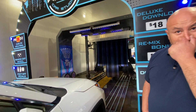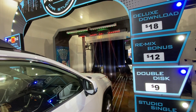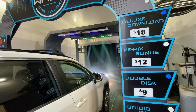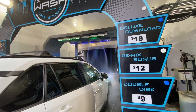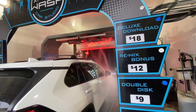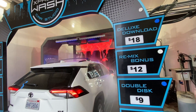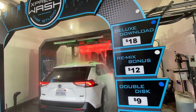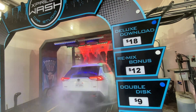This arch is all reclaimed, loads on a 20 horsepower pump. The arch itself is for 96-inch vehicle clearance, six spinners, all reclaimed — 130 PSI at 140 gallons per minute. It's putting the reclaimed water to work. It comes with the LED lighting package, which really gives that show to the customer, and also knocks off and loosens any bird droppings, bee droppings, and excess film on the vehicle.